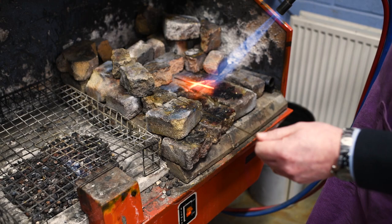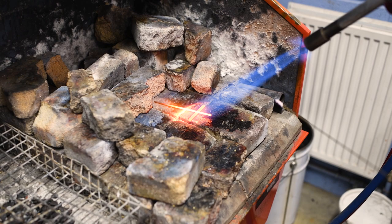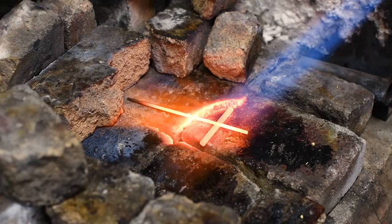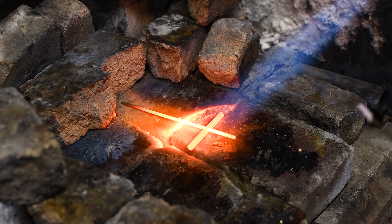The brazing rod is a brass alloy. The end of the brazing rod is heated and then dipped into the powdered flux — the pink powder in the tin. The flux aids with the flow of the liquid brazing rod and also slightly etches the surface of the metals to make them clean. The top rod, being only 3mm in diameter, heats up much quicker than the larger 6mm rod. Therefore we need to make sure that both pieces of metal reach the same temperature to allow the brazing rod to flow and join to both parts. Otherwise the brazing rod will just fix to the hotter parts and the join will not be made.